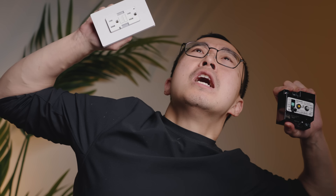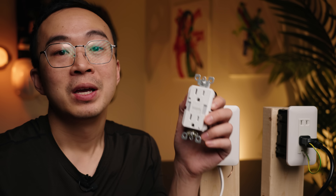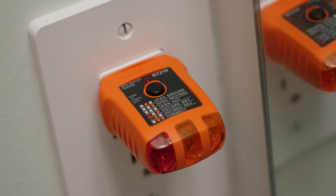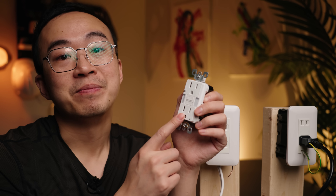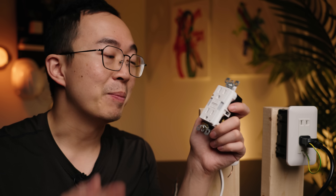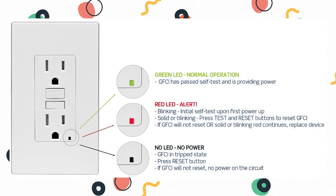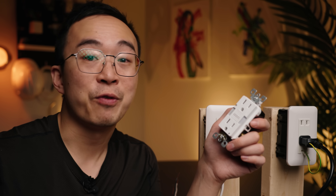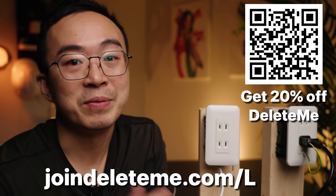We can argue who has the better system, but the lesson is that GFCIs are superheroes. Two things you can do: One, check your outlets with a tester — not only does it detect wiring faults, but pressing the button should trip the GFCI. If it doesn't, it's broken; replace it. Two, think about replacing GFCIs older than 10 to 15 years — the mechanicals inside can break, and newer ones have a self-test feature that automatically checks if the circuit is working and disables the outlet if it doesn't. I'll have more information, sources, and product links in the description below, plus a newsletter I send when I release new videos. Check out Delete Me if you want to improve your privacy and safety — use my link below to get 20% off.